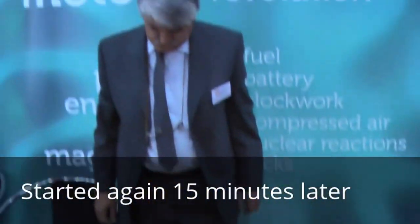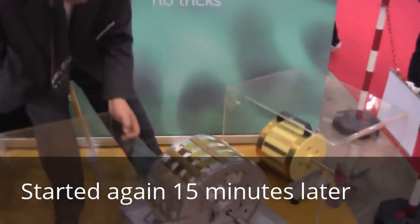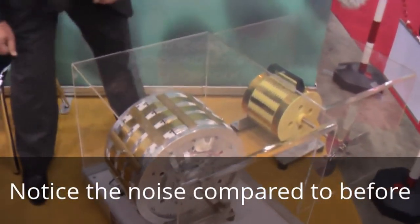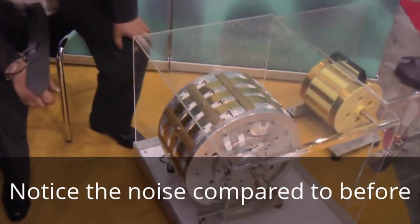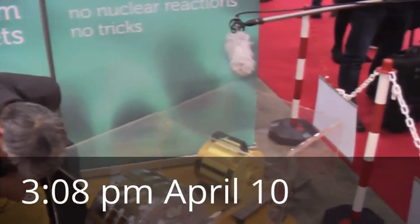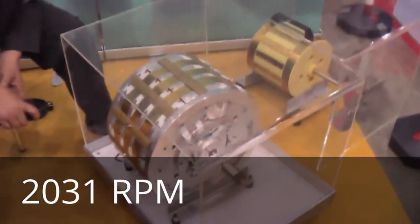Simple silicone to mount the magnets in their holes. One of the magnets again is going to lose its position. So it's set in there. It's a combination of the magnets. It's a series of magnets. When one of the magnets loses its position, then the second, the third, the fourth, and the fifth magnet will be broken, and the motor loses its speed. So at night, when we go home now, we will open the motor, find the broken magnet, put a new magnet in.